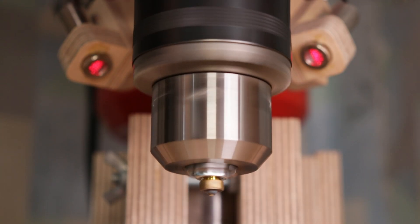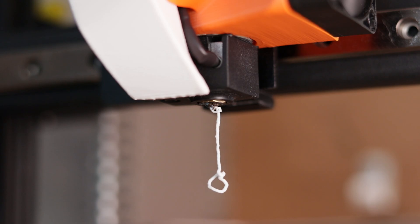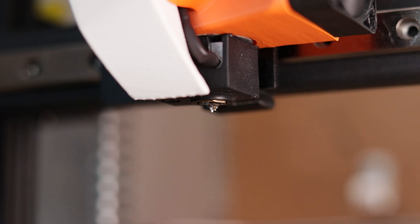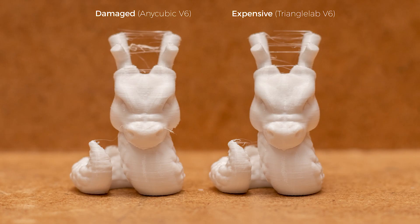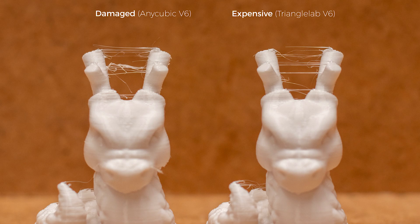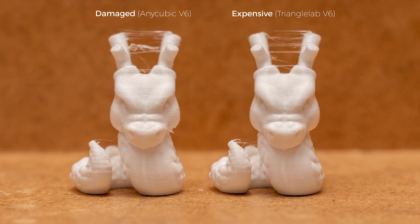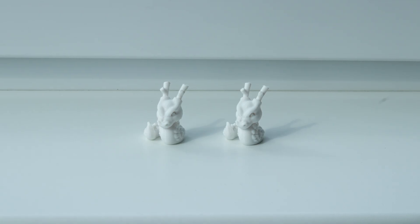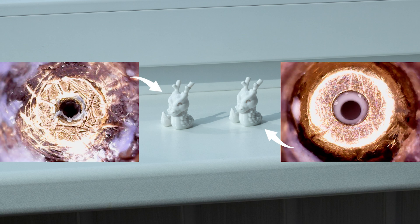The only question then is how far we can go. This time I absolutely destroyed the nozzle — it is extremely rough and the filament just curls upwards. But this time, instead of easy-to-print PLA, I will be using PETG as it sticks to the nozzle like crazy. That, combined with an uneven surface, will give the worst case scenario of irregular lines and unwanted blobs in the print. And did it do the trick? At this point I don't know what to say. Yeah, it looks worse — there is more stringing, some bad-looking overhangs and definitions don't pop out that much and look more flat. But if you would say this was printed with an abomination like this, I would say it is a straight lie. Looking at these without specific graded lighting conditions and with strings removed, it is mind-blowing how similar they look given the drastic difference in nozzles.